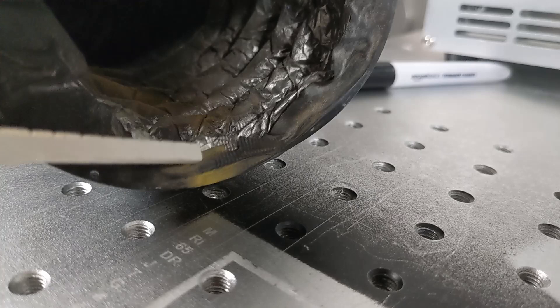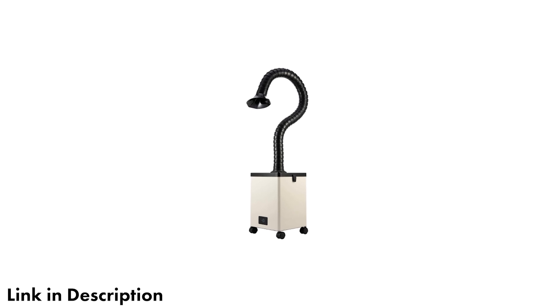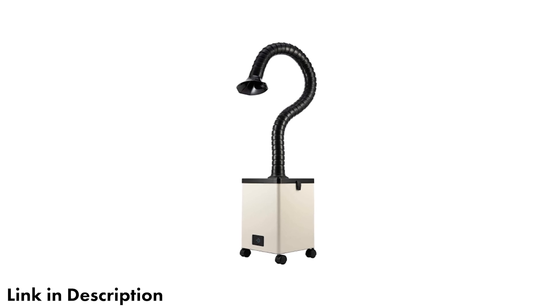The other problem we're still having is that I'm not a jeweler or a goldsmith, so this isn't a huge thing for me — but people are going to struggle with how much gold they're losing when you need such a big kerf on the wobble to cut through without re-welding. There are different ways to collect that gold using extraction. One simple solution offered to me: grab one of these Ohmtech exhaust fume extractor units and only use it when you're cutting gold. All the buildup that collects inside the machine will be gold. Getting it out to reclaim and remelt is outside the scope of this channel, but at least it'll all be collected in one spot. There's a link in the description.